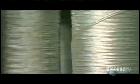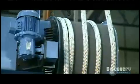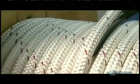These dancing bobbins do some fancy moves to produce different weaves around core ropes. They dip around in between each other in a choreographed sequence. But there are no worries about production hitting a snarl. If a yarn breaks, the machine simply shuts down. It takes 8 to 10 hours to make around 3,000 feet of this large utility rope.